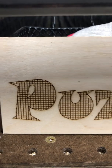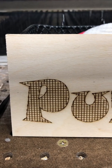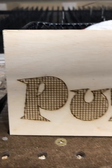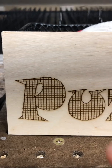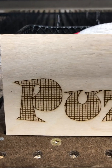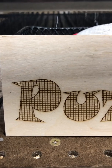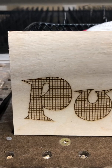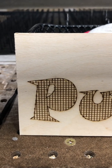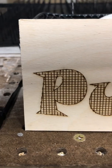We won't talk about the acceleration problem — this is about start and stop where the code is set back to back. Marlin executes that code very rapidly and almost completely smoothly between commands, like tracing a lined P with small lines — it's very smooth, whether using a laser or a router, because it fires commands and calculations to the motors back to back. But when you insert one tiny laser on or laser off command — M106 or M107 — that's where the problem starts.